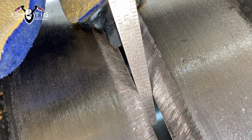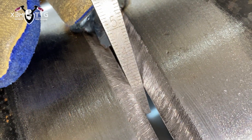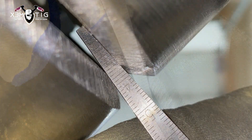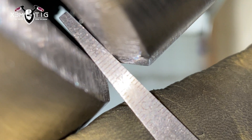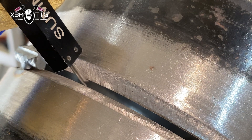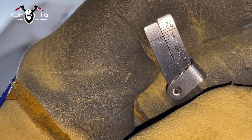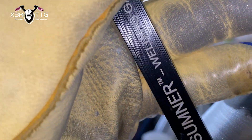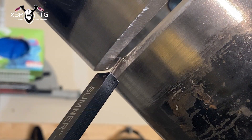Pretty much the same thing. As I said, the gap is around 3mm — it's not even all the way around, it's three to three-and-a-half mil. Some spots are a little bit tighter, no biggie, as long as I got room on the bottom. This is usually where I always start and I try to make sure everything is perfect on the bottom part of the pipe. A high-low gauge is a good tool to fine-tune fitup. I got about 2mm difference on the top, which is not a big deal as long as the bottom is perfect.